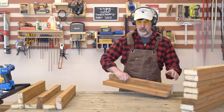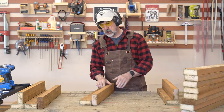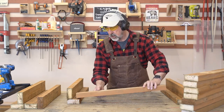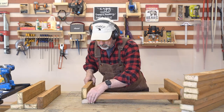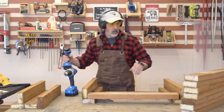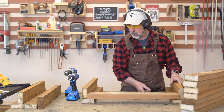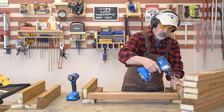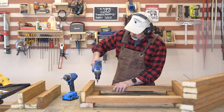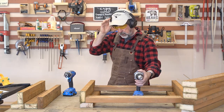Let's put the frame together. On these legs you have a short side and a long side — put the short sides together. The lengths of all these boards are the same, so I'm going to get it flush with the top and square. Then I'll pre-drill and put two-and-a-half-inch screws in. I'll do that for the other short side and be right back.